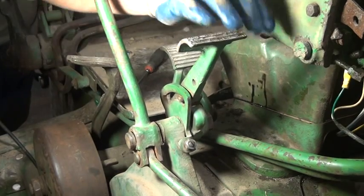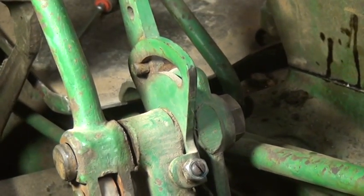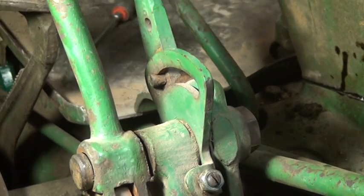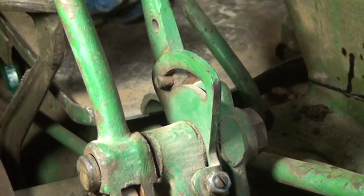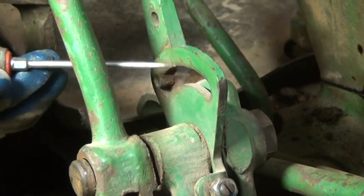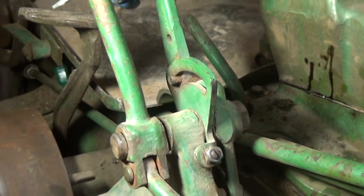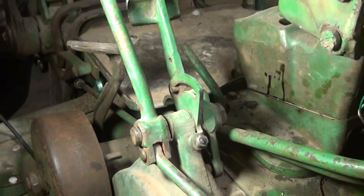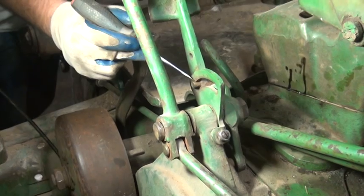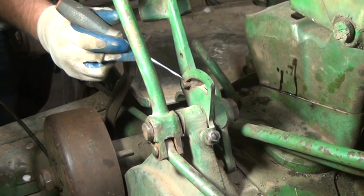Now when we disengage, we push on this pedal, and the inertia from disengaging it when you stomp it down should lock this little peg right here, and there's sort of a recessed area in this slot. That's what actually positively engages the power shaft clutch brake. And when this is engaged, we know that the linkage is approximately set in the ballpark.